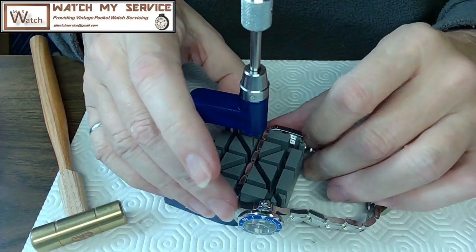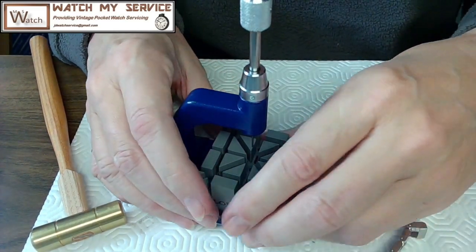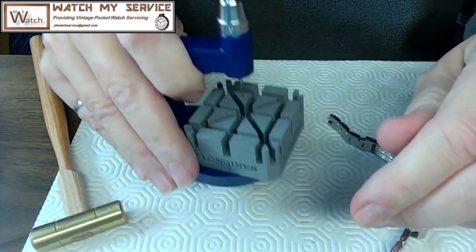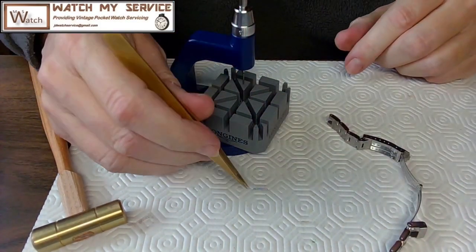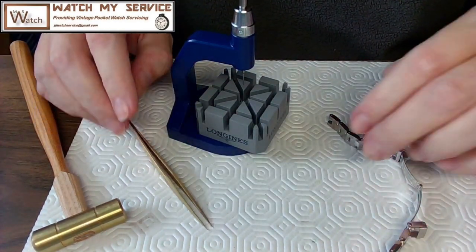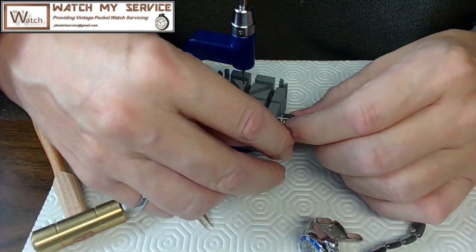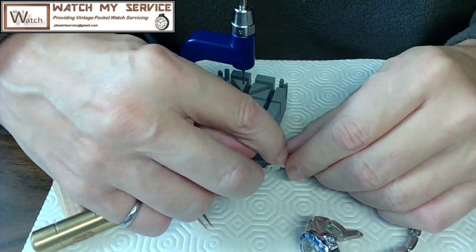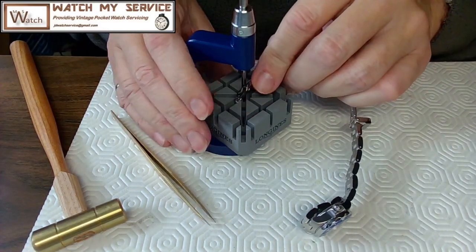I'll pull that out, and if I pull this watch apart, pull this up like this, and I've lifted the whole rig up, and I can see a pin down there. So that's pin number 1. And take this pin here and just put this in with the stakes, right? So now we've got it separated. The next pin I have to take out is this one here, because these 3 are the same level. So I'm just going to put this back in like this.